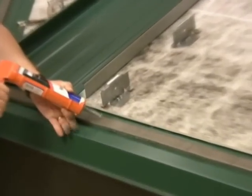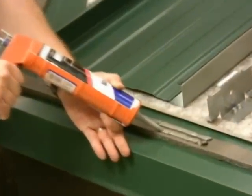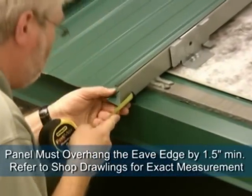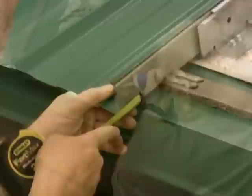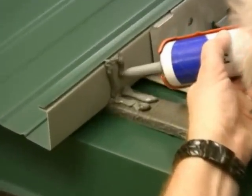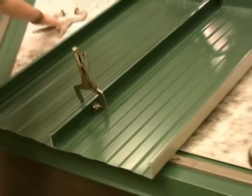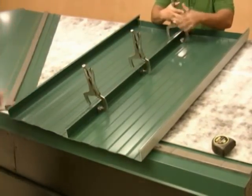Slide the panel to one side and install sealant on the eave foam closure. The sealant is applied in two rows of Garland's non-curing, non-hardening gunnable butyl caulking. The panel must overhang the eave edge by one and a half inches. This will accommodate thermal expansion and contraction at the eave. With the panel properly positioned again, apply sealant for the next panel. Run the two rows of sealant up the seam leg to prevent windblown rain and capillary action. Install the adjacent panel and clamp into place. We are now ready to anchor the panels to the clip and create a fixed point.